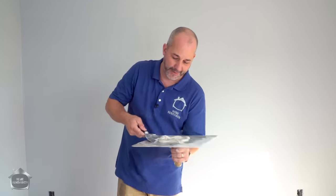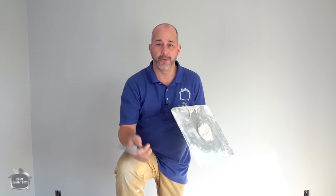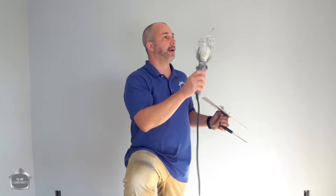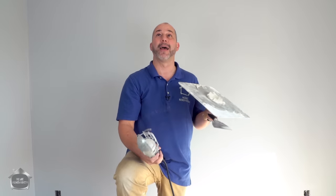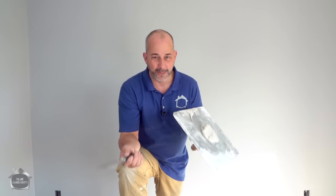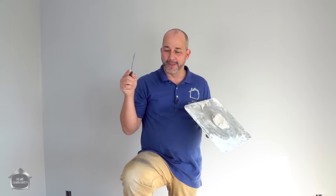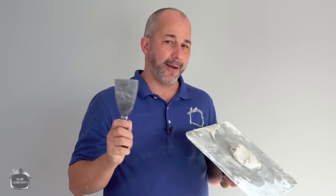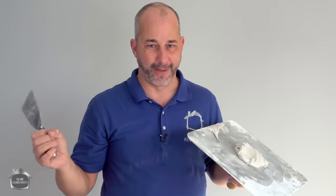All right, so traditional building process when you're working with your drywall, it's pretty much, you do your 3 coats of mud, you sand the room, you prime the room, you do a prime check, and that's the process traditionally of taking a light like this and walking around, checking your inside-outside corners, looking to see if all your nail holes were filled properly or if you have divots. I had a few divots in the other ceiling. Not a big surprise. Like when you're doing your drywall work, you're gonna run into situations where different aspects of the work only got 2 coats instead of 3, or the screws were put in just a little deeper than usual. This is why we do a prime check, just to help take care of all those little imperfections. And it's a lot easier after you've sanded the ridges off to go back and fill the divots and the scratches than to try to sand everything perfect the first time.